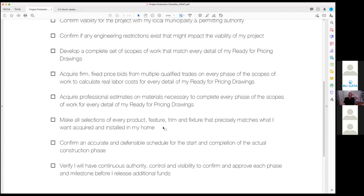The first question from Caroline: if you're not changing the footprint for a remodel, do you have to worry about setbacks, even if your historic lines don't meet current standards? Yes, we talked about it briefly in the presentation. If you're going straight up from there, you need to pay attention to it. If you have a porch or something like that that you're enclosing, you need to pay special attention to it. But in general, you should be able to go straight up from the original footprint of the house, not including porches or anything that were closed in since then. But you should be able to go straight up from that, no matter when it was built.